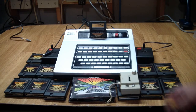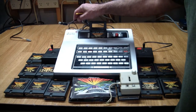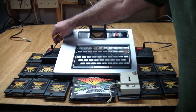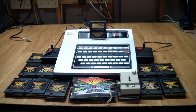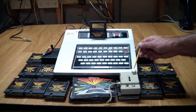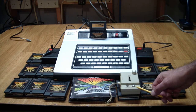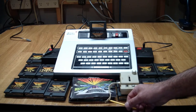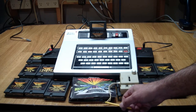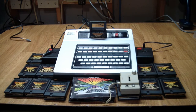These switch boxes were very common in the 70s and also the 80s, because you get an RF modulated output containing the sound and video on this RCA plug, and that usually goes to the antenna terminals on your television set. This made it easy — it had an RCA input for the game, antenna inputs for your external antenna, and then you just screwed those to your television and could select between the game and TV shows.